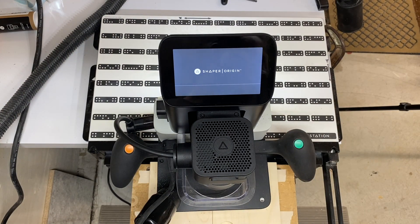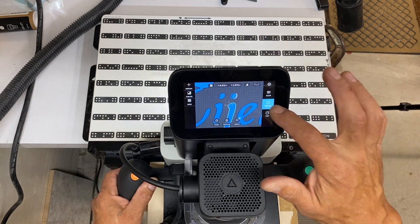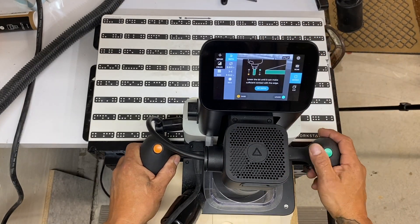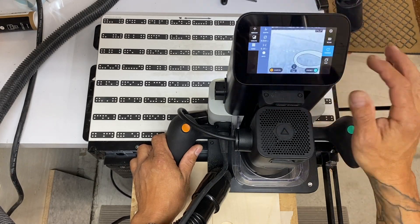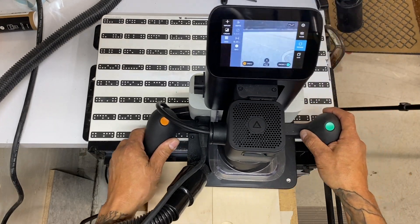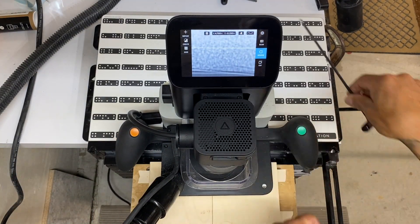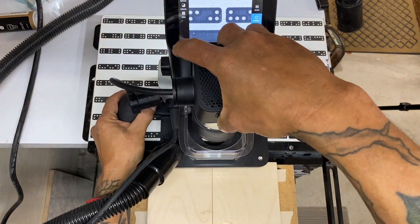You may have noticed I've installed a quarter-inch router bit backwards — in other words, the shaft is hanging down — and we'll use that as a reference. Right on the machine, we'll go with a new grid. You can see the bit drop down, it makes contact with the edge, you move it over to the next place — that's X. Then around the corner, and you've established the Y-axis. We'll drop the router bit back in and we're ready to go.